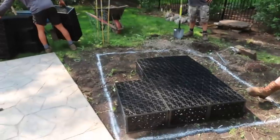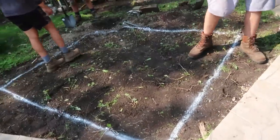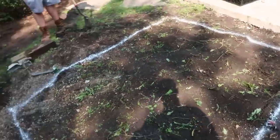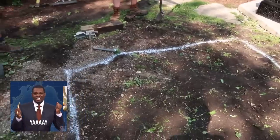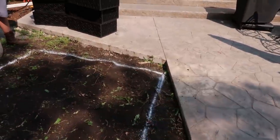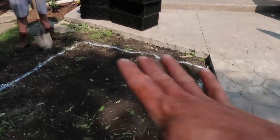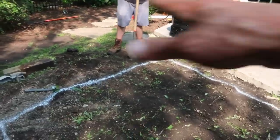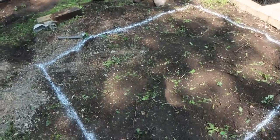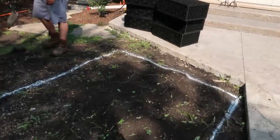You can see Grant and Jonathan lifting up the aqua blocks — this is going to be the perimeter of the reservoir. We've got 12 small aqua blocks, which gives us about a 200-gallon system, more than enough to supplement the medium urn and the small sphere. We're running into some crummy digging conditions. We want to go off the elevation of the existing patio, so the top of our aqua blocks will be about where Grant is standing. Those aqua blocks are nine and a half inches tall, so we're only going to go down about a shovel depth. We'll throw the dirt back to help retain the back side since everything slopes back, put the steppers back in, and leave a couple of wheelbarrows of soil off to the side to help backfill along the edge to bring soil up about an inch below the top of the patio.